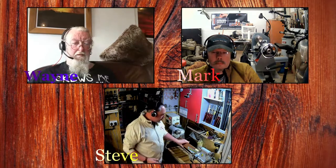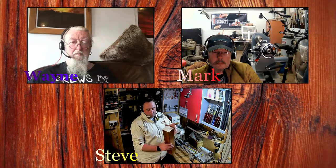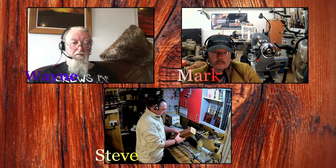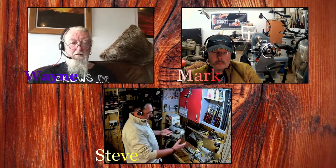I've got a piece of pitch pine here. It's an old newel post from a staircase. So it's 4 inch or 90 by 90. And I've cut this about 420 mil long. Just enough to give me an end to holding the chuck and to part off.